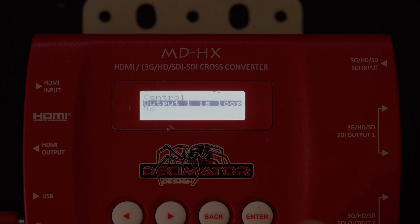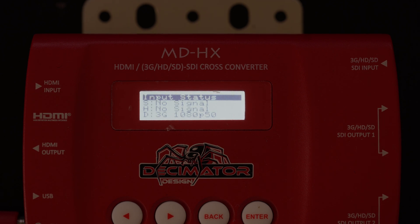I've got mine set to no, so it won't copy whatever you put in. Now that may be useful if you're using it for something like — say you want to bring in a camera, but the projector you're feeding to doesn't take 1080p 50, it only takes 1080i 50. So you could therefore use your up-down cross and send it out as number two, or send it out on the second output, which would then go to your projector taking the 1080i 50.